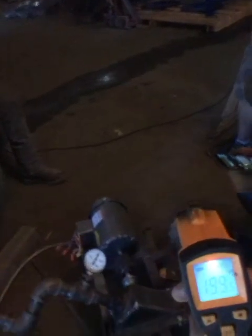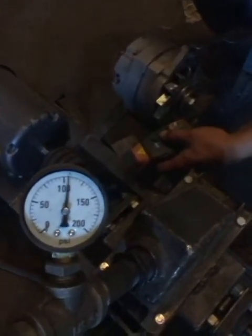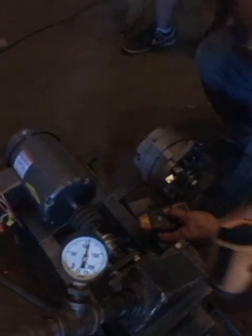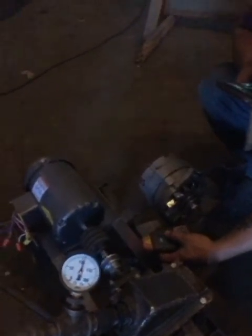We're going to give this a little longer and come back when we're over that. We're right at steam temperature, and that's why we're starting to pick up speed. Now 360 RPM at 105 PSI. The pressure is coming up a little bit as well because the temperature is rising. So nothing has changed here except for the temperature, which is going to continue going up.